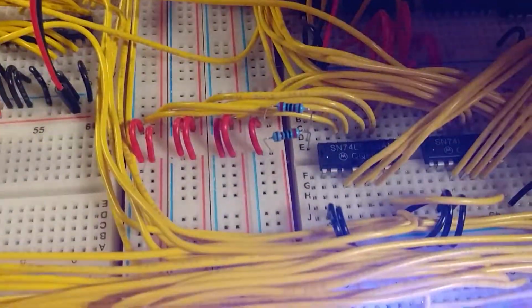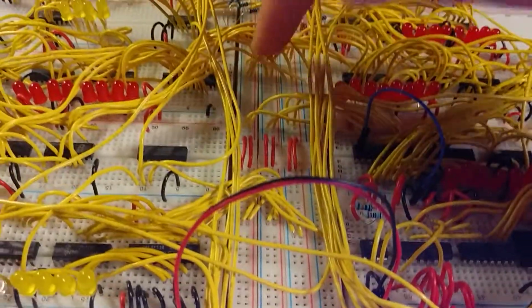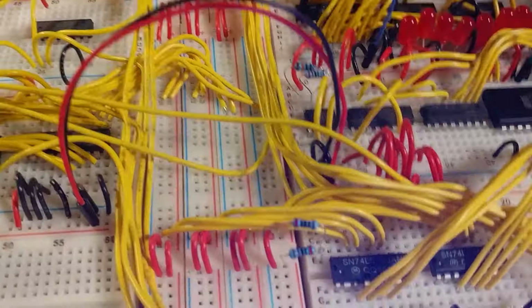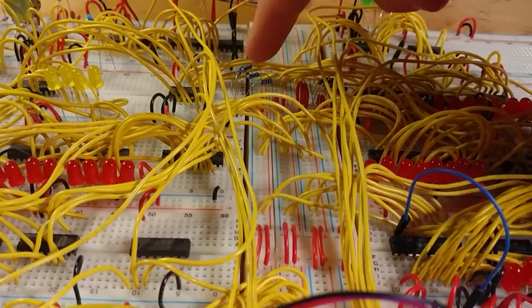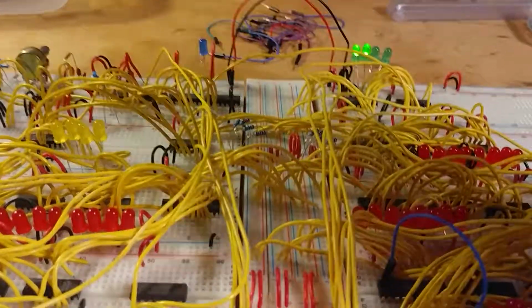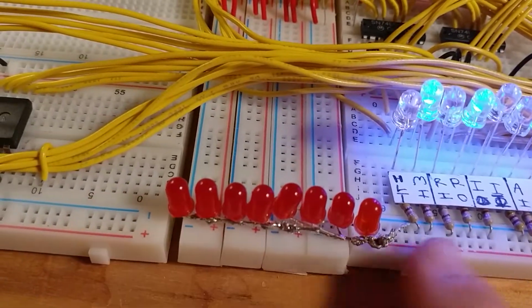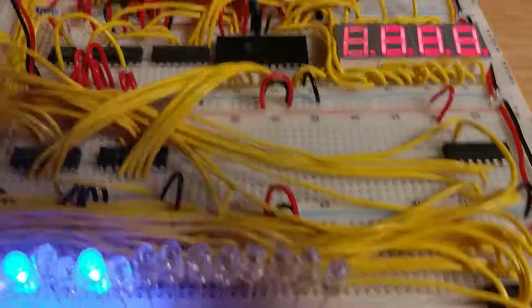But then if for some reason one of these modules is asserting a positive value, so a 1 on one of these bus rails, that's a path of lower resistance, path of least resistance rather, than going through this resistor. So it'll prefer the high instead of the low, and thus a high value will be represented on the bus, which I think is very interesting.